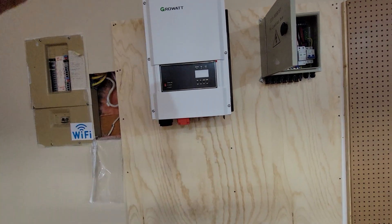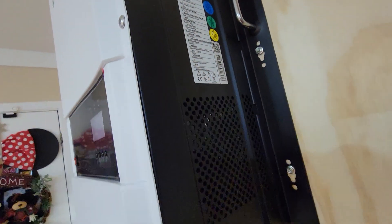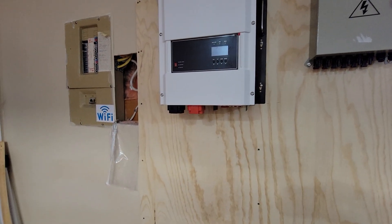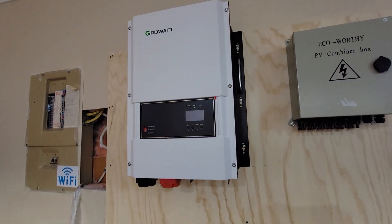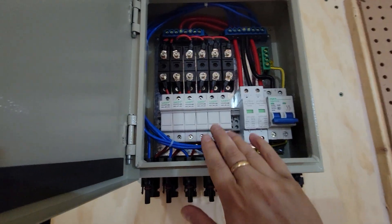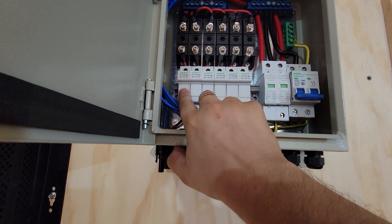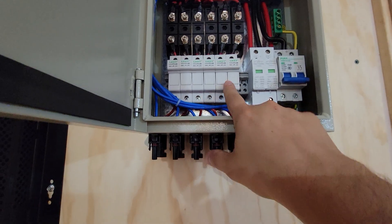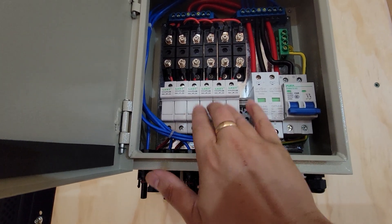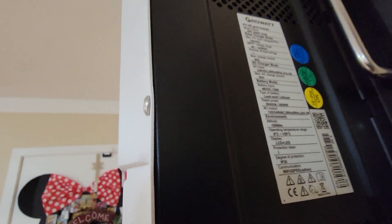When it's sunny out I still power the house. I'll have to apply for a permit to backfeed the grid if I want to. There are all the safety tests that were made on it, for the inspector or whoever is going to certify this to see. Very simple system — series of eight, wires along the side, wires come in, installed here, power from here. What's nice about this is if one of these fuses go, I'll know what string. I'll mark down what string each panel is in. They'll have two strings open for the future if I want to add more panels or different allocations to run in series. This is an 8,000-watt inverter — very strong, more than what I need. It is a split phase, 120-volt to 240 split phase.